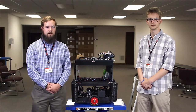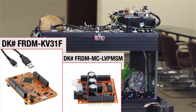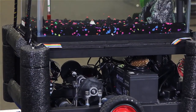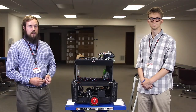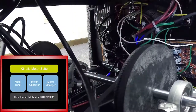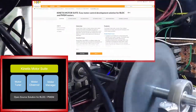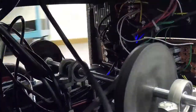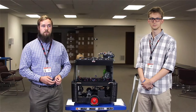The drive system is based off of the KV31F from NXP. It runs Kinetis Motor Suite, which is a tool that allows you to tune your motors very precisely. The motors on here are three-phase brushless motors running at 4,000 RPM powered by 24 volts. The Kinetis Motor Suite uses ADRC — Active Disturbance Rejection Control — which is a very precise way to accelerate and decelerate motors based on varying loads, similar to a PID controller, but with much faster response times and much lower overshoot.